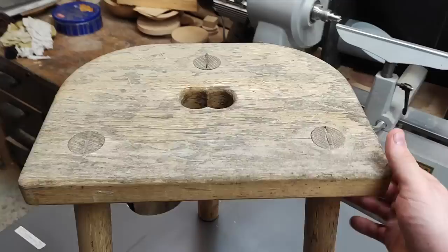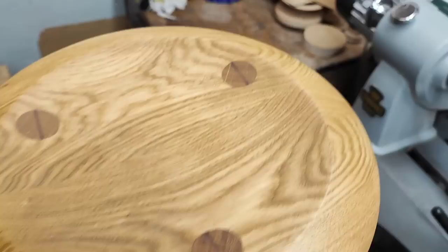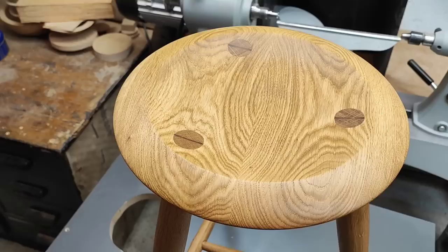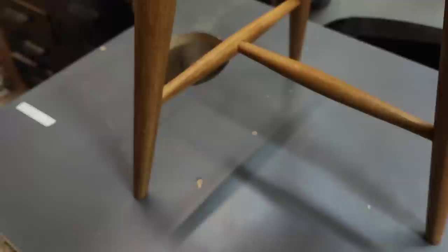This is my stool, so again oak, and you can see the joinery. So it's three legs, jointed at the middle, two boards, you'll see how I do that, and there's two stretchers, and this one is also with the wedge. These outside are not, it's a nice tight fit.